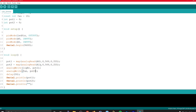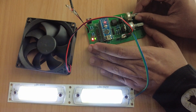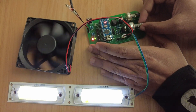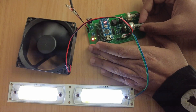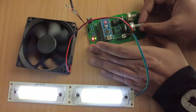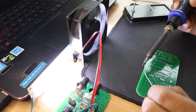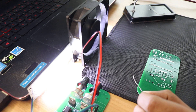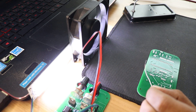This will turn both MOSFETs on and off. After controlling the MOSFETs on and off, it controls both the LED and the fan. If we rotate the potentiometer, we can control the brightness of the LED and the fan speed. All the soldering fumes are absorbed by the fan, and the LED provides comfortable lighting for soldering.